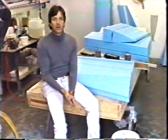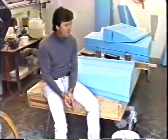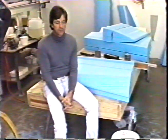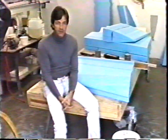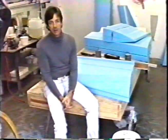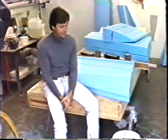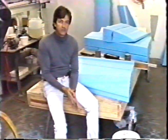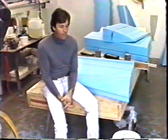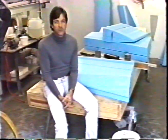The particular point I wanted to cover this morning in regards to this tape is that before bar sanding, you need to assess what your foam cores are doing. We center cut our cores, as I mentioned before, but there are minor inconsistencies from billet to billet that we cannot control. When we bond them together, we negate some of these flexural qualities, but they're still going to be different from wing to wing.